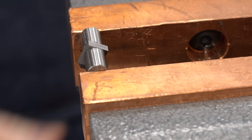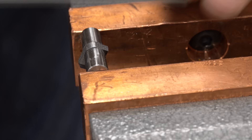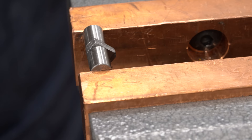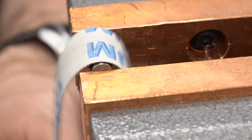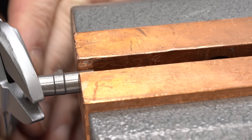Then we can clamp this between the vise jaws and file away. I'm using a long rocking motion on the stroke to follow that curve. This gets it generally into shape, and once the file comes in contact with the filing guide it'll skate over it and recreate that curve. I didn't harden these so the file is cutting into them, but I'll only use them once — totally suitable for this task. Flip it to the other corner, do the other side, and finish with long continuous strokes to make it as smooth as possible, then clean up with 400-grit emery.